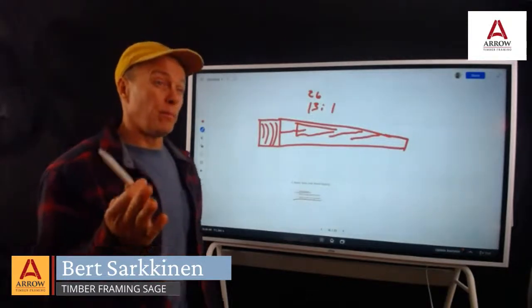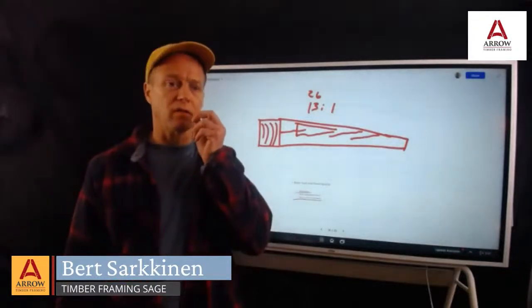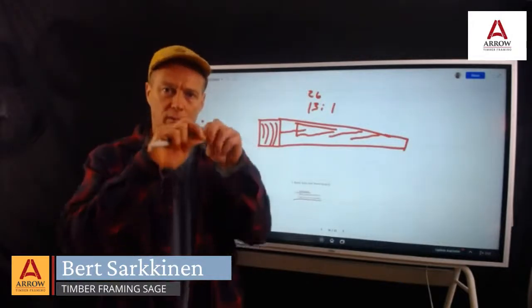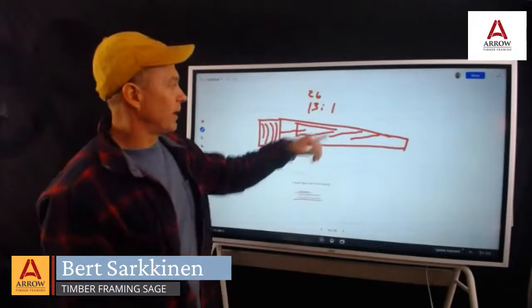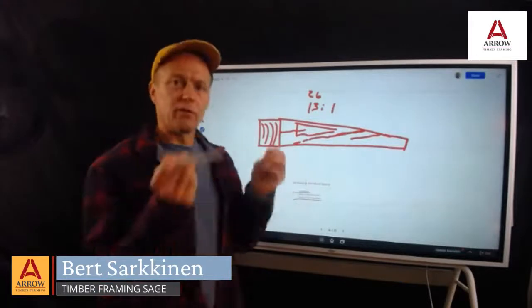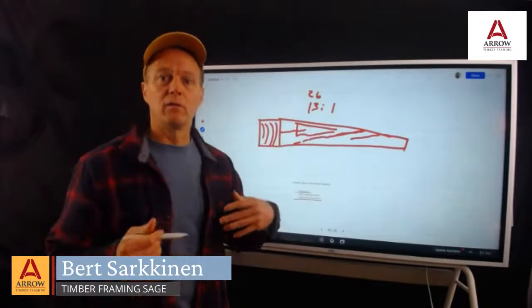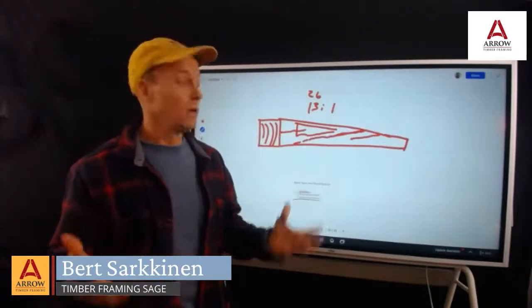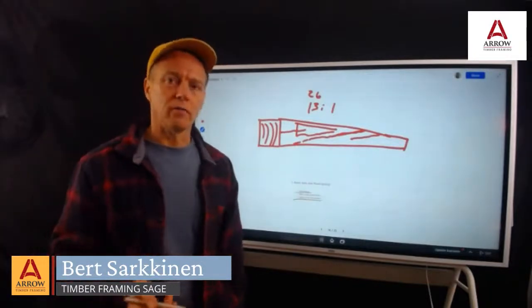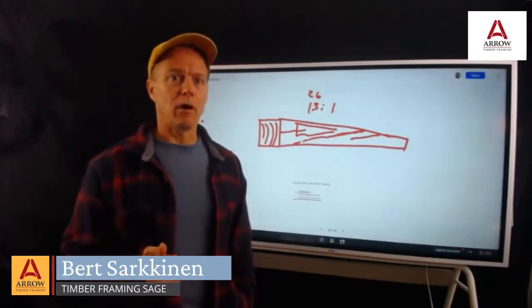In a practical application, if you've ever been working with a toothpick and all of a sudden it just snaps, and it almost creates a double toothpick with some long angles, that toothpick has spiral grain, and therefore it snapped off and gave you two pieces with sharp edges. That's an inherently weak piece of wood that is a little tougher to spot. But if you know what you're looking for, that's something you don't want to have, unless the piece is so oversized that it's not a problem.